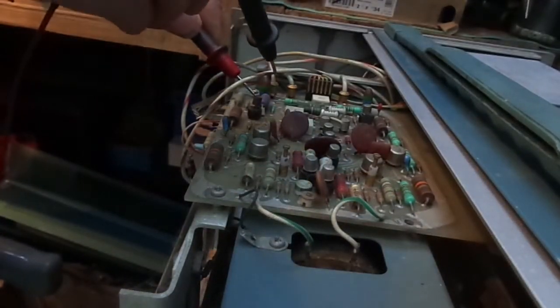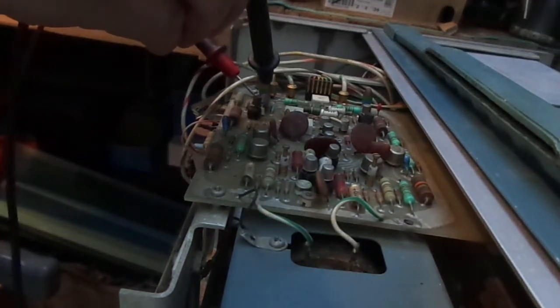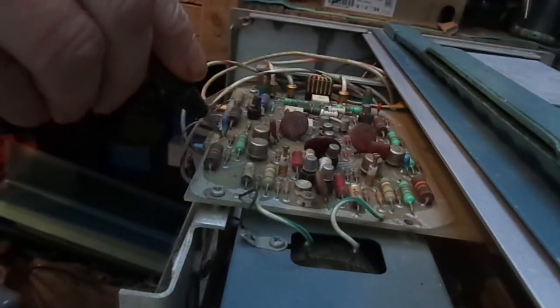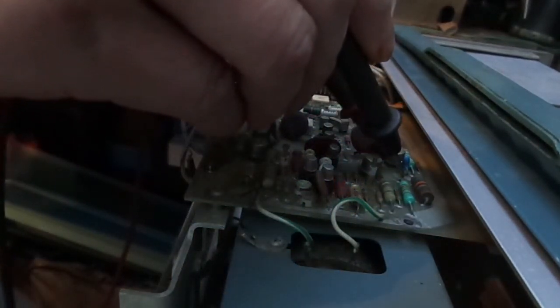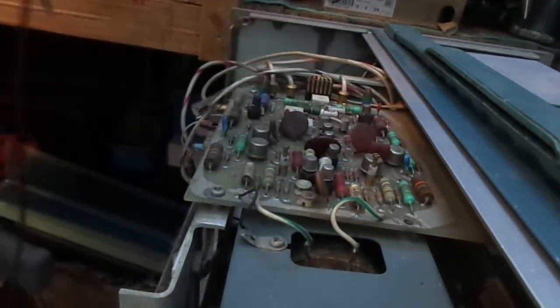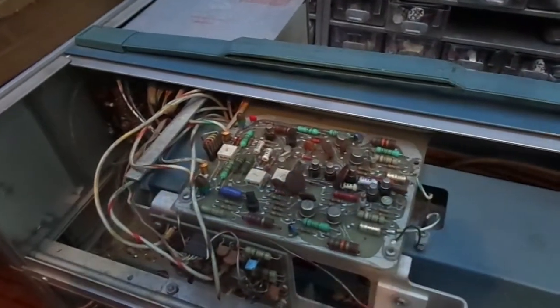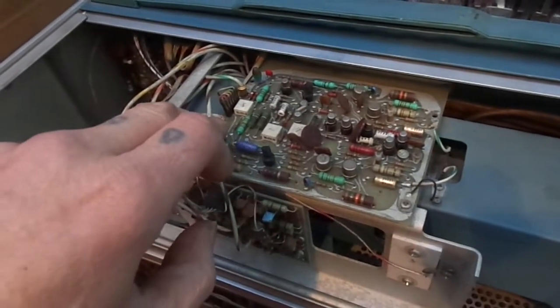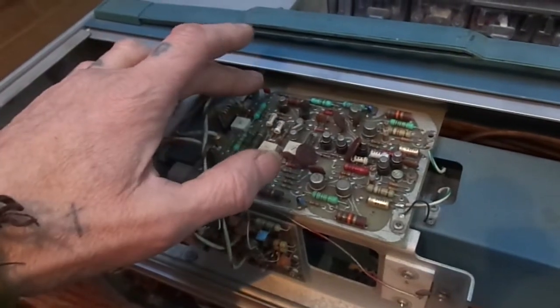What I found was — that's indicating a short circuit. Short... short... short... there's another one. That could just be another resistor or part of the circuit. I've tried the DC resistance — one is measuring 100 ohms, the other one is measuring 70 ohms.